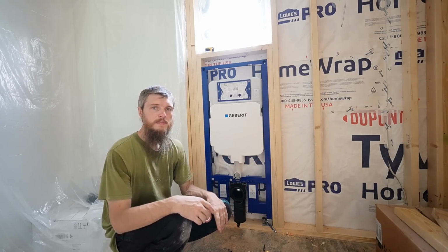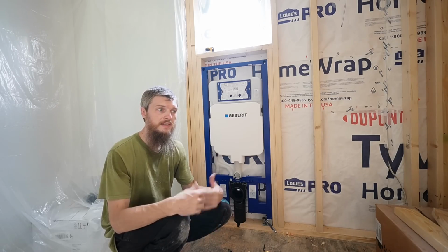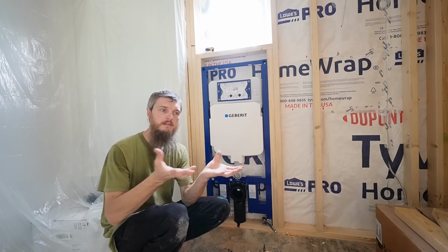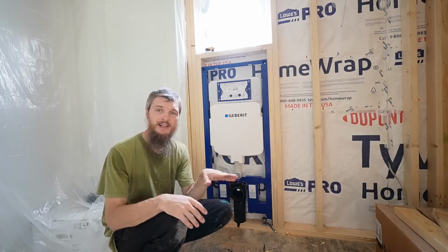I think our toilet seat height is going to be closer to 18 inches. So it's a middle ground where we can all be happy. It's probably higher than we'd like, but it gives us more flexibility and gets that toilet a little higher off the floor. We want to try to maintain the idea that it's easy to clean. Some wall-hung toilets are very sleek and compact in the bottom. This one is a lot more filled out, so it sat a lot lower than we expected.